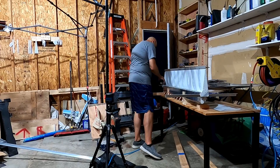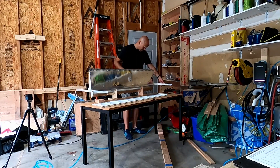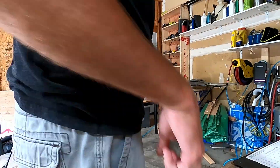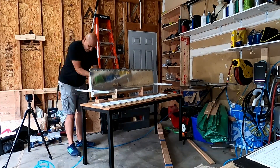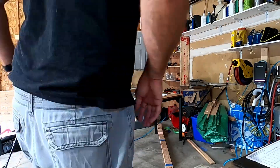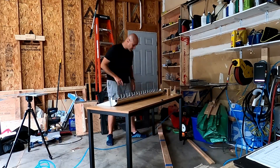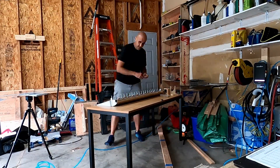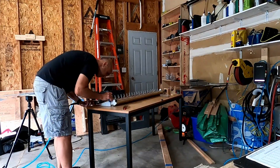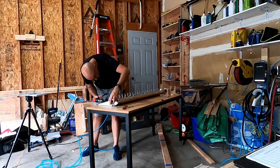This is making sure it's as straight as possible before the bottom skin goes on, because once that bottom skin goes on, whatever twist is in it is really locked in. The top skin is on but the bottom skin is not — just getting the last of the twist out, double-checking, triple-checking. I also had to rivet the spar to the ribs, which is a tough job. I did this out of order with the plans, putting the brackets on after riveting the spar to the ribs, using a very long rivet set.